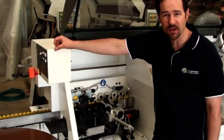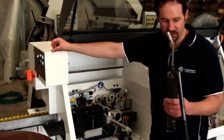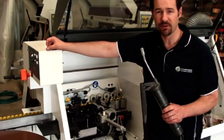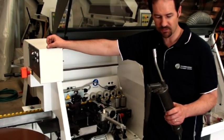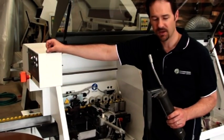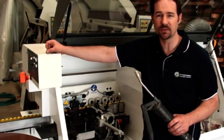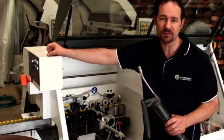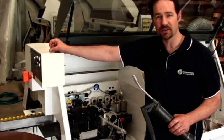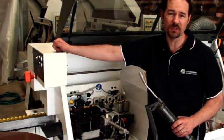The model I'm working with today is the Paoloni B10. When it comes to using the grease, there are generally two types of greases available for doing high temperature bearings on a glue pot. You've got a general purpose high temperature grease, which typically goes up to 200 degrees Celsius. This is the sort of grease you can buy from most automotive shops, typically off the shelf, as long as it does go up to 200 degrees Celsius, because there are lower temperature grade greases on the market. Generally those greases are relatively cheap and obviously not as good as a more expensive product.